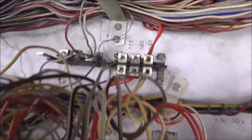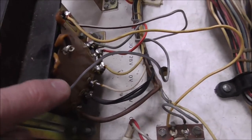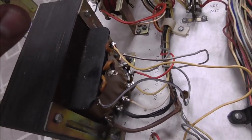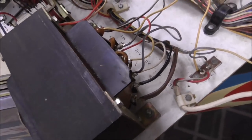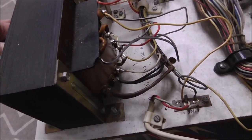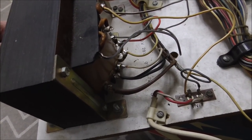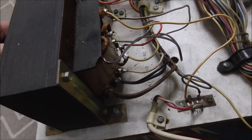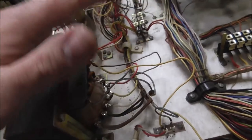So it's built in where you can make the flippers more powerful and the pop bumpers more powerful if you want. Gottlieb had a similar thing, but you had to change a wire soldered on the transformer. And they called it highlining. What do they call that? Not highlining, something like that. You could basically change a wire to make everything more powerful.